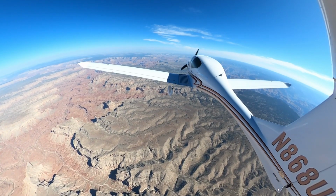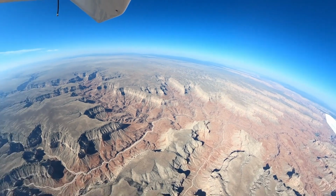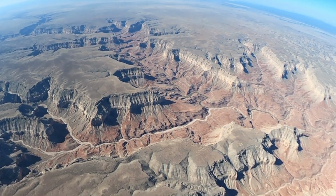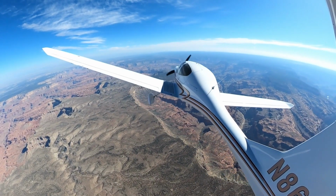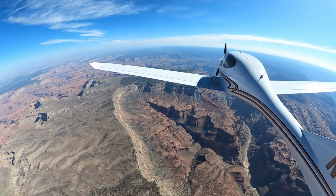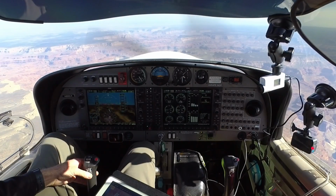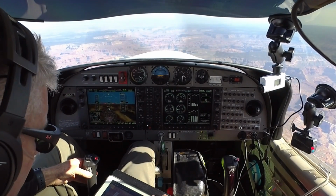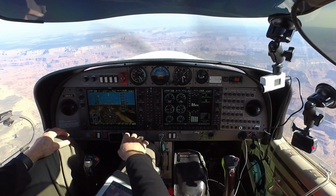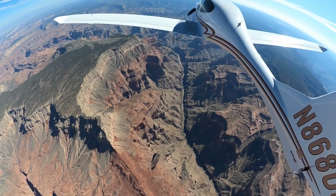And so we popped the top cowling back off, and we had to snap the quick drain a couple of times to be able to get it to fully seal. That's a common thing with these quick drains when you're draining out the bottom of the oil pan and you have debris coming through there. Sometimes a little bit of debris will settle in the seal, and you need to snap that quick drain a few times to try to dislodge any kind of foreign debris that's causing it to just slightly leak.